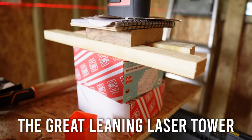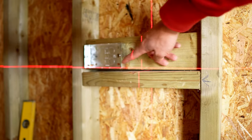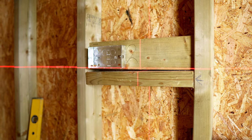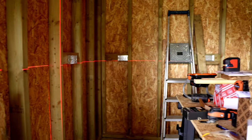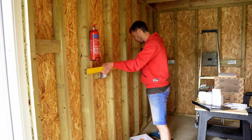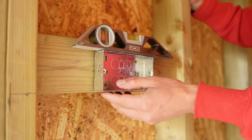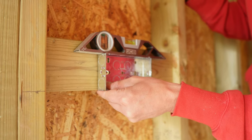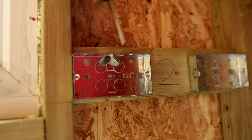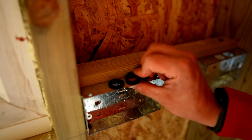This is one of those jobs that is a lot easier with a laser level. I've got the laser level set up so the line is just touching the bottom of each metal back box — I will not move that laser and will go around the entire perimeter making sure the laser line falls on every single one. If you don't have a laser level, you can still fit these using a spirit level. After all of those were in place, I went round and popped out the top two pieces of metal in each back box and fitted in a rubber grommet to prevent the cable from snagging.